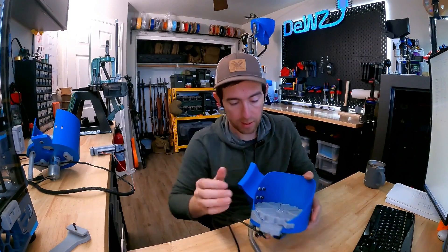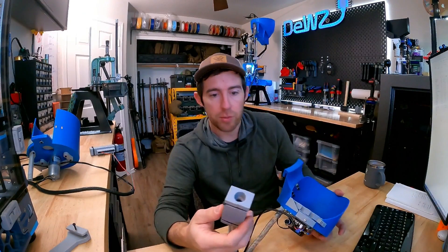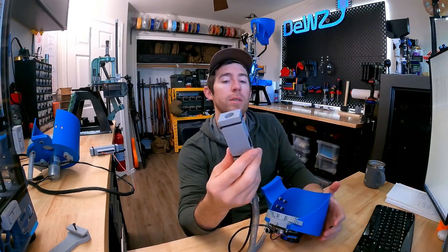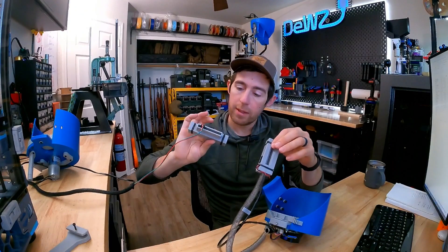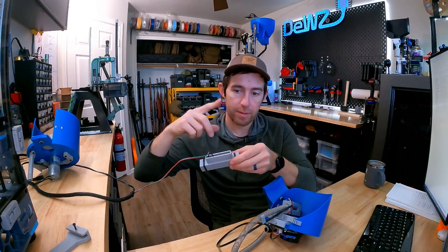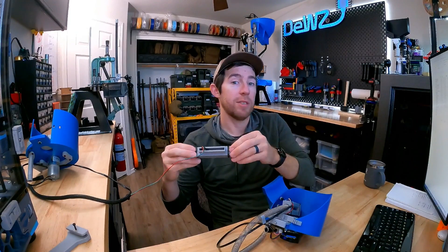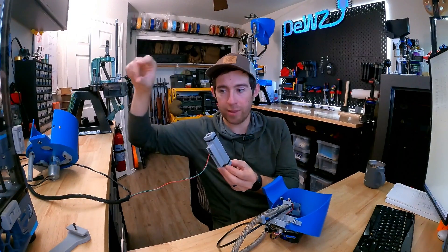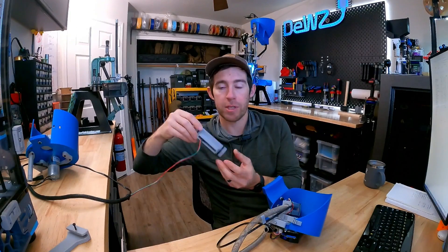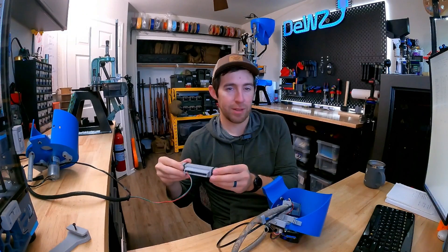I think the last big upgrade or feature change is that it's now an optical feeder stop switch, versus the older one that had the micro switch with a little lever. That original one actually didn't give me many issues — I think I only had one time where it was stacking up bolts all the way through the spring, just by chance. It was really a good design and it worked, but it was finicky getting set up.